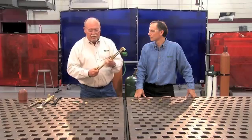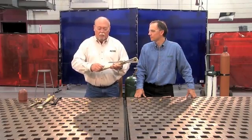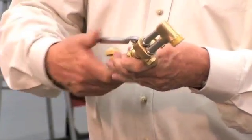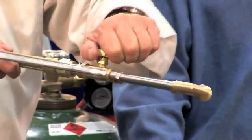If we use a wrench on it, you're going to damage the o-rings. So we're going to hand-tighten this on there. After you get that on, one of the things we want to do is open this preheat valve all the way on the handle. If we don't open it all the way, you'll get a restriction in your cutting oxygen. This will now be your preheat adjustment for your oxygen.